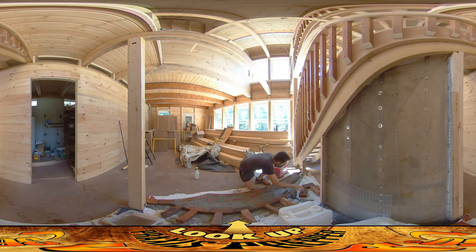I'm just doing a straight line across the front, a run over there, and then the bricks are running over here, and then I'm cutting them at an angle using that diamond saw again. I found that it's much easier to cut these bricks when they're dry. Once you wet them and clean them, if you try to cut through them when they're wet, it seems like it's a lot harder when they're damp.